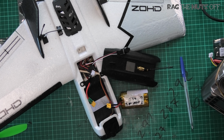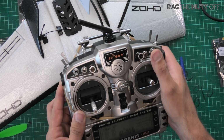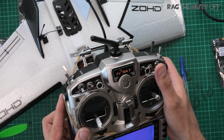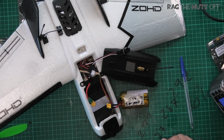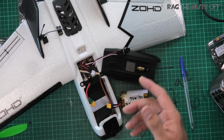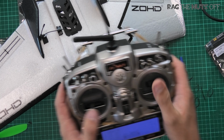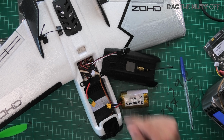All in the same hand. And let me show you how to set up a switch on your transmitter, or flaps in this case, so that you can turn this buzzer on when you've lost your model. Maybe you've dropped it into a field of crops, or you've just landed in the field you were flying with, but the grass is a bit long and you want to walk straight to it. Instead of twiddling the sticks away trying to hear the servos, just click the switch on your transmitter and you can walk straight to it.